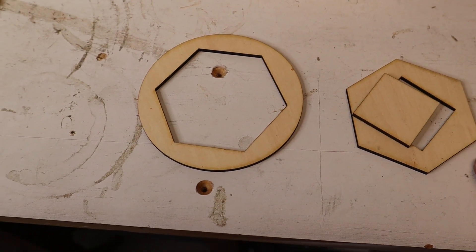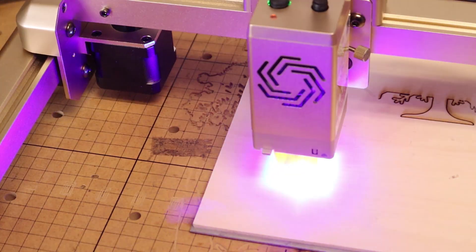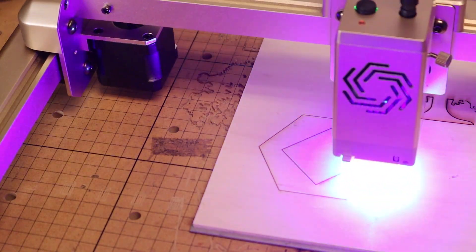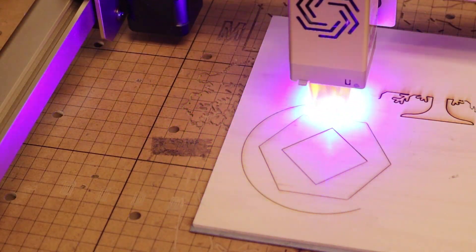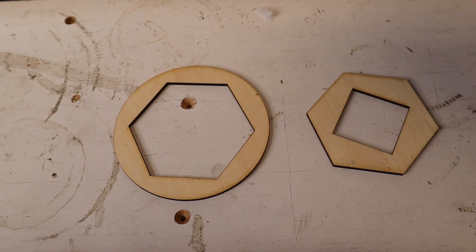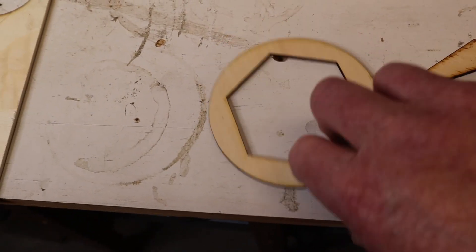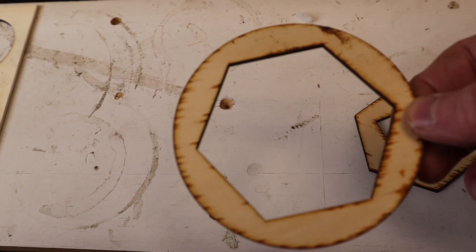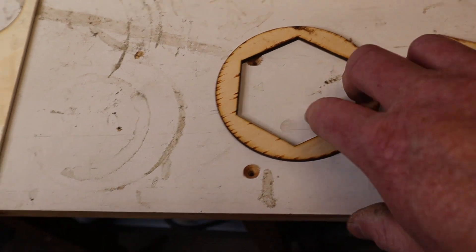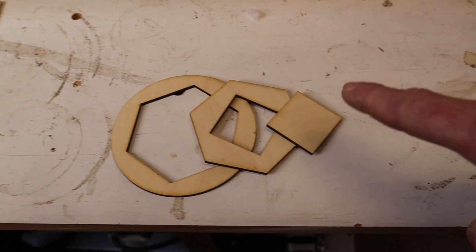This was the cutting test with three millimeter plywood, which is pretty much the standard size for most people doing laser engraving and cutting. You get pretty clean edges — the piece came right out. I did have to do two passes, but I'm okay with that. There was some charring on the back, but not a lot — I consider that acceptable, and that was without air assist, so a little bit of burning on the back is expected.